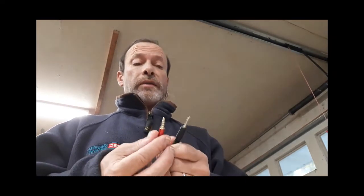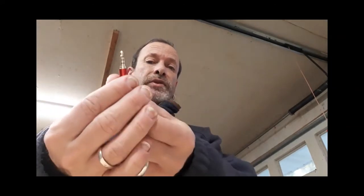The default cable that comes with it is meant to attach to a handy talkie such as a Baofeng, and it's a real easy setup. But in his case, he wanted — or had — to build a cable to interface with his mobile unit. I told him you need a four-conductor jack and the associated wiring, and on the other end you need the same thing; get the wiring diagrams for the repeater and your radio, plug it in, and you should be good to go.